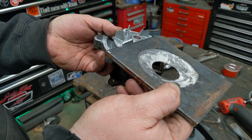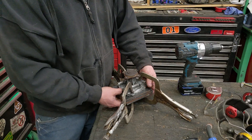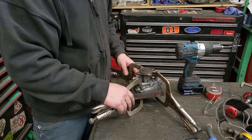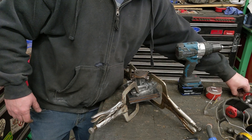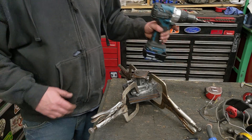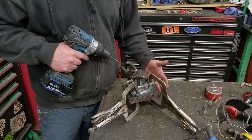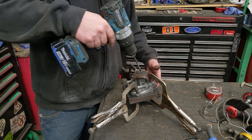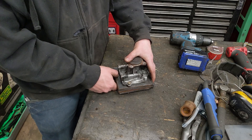An eighth inch off the top - I'm going to trim those. Okay, it's all pretty much assembled. I got all those layers on there. The impeller is just barely touching in a couple of spots, but I don't have a gasket between the layers - I'll probably use the gasket that came with it, so that'll space it off enough. If not I'll sand it. Now I've got all the holes lined up. I didn't want to pre-drill the holes because they move, so now I can go through the plate and everything all in one go. That's where the fluid goes in, but we have nowhere for the fluid to go out - so that's where this comes in.